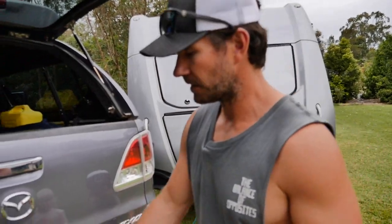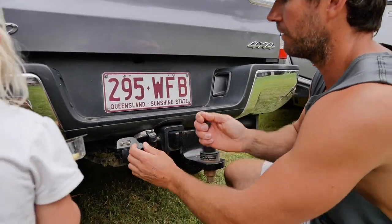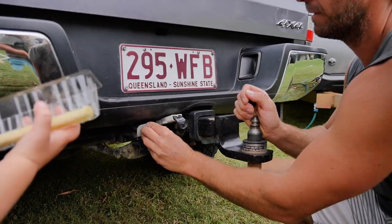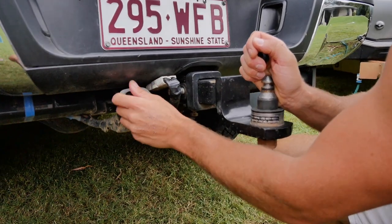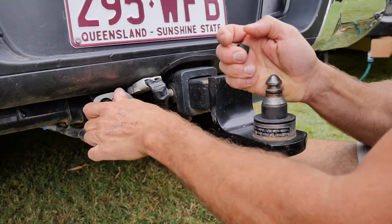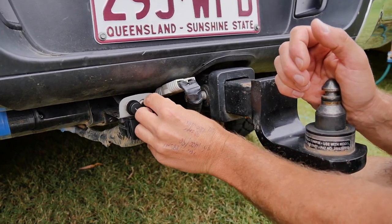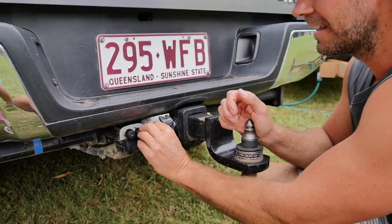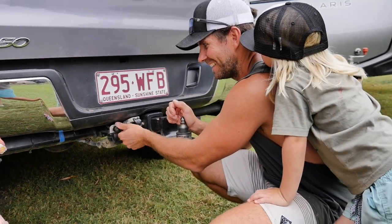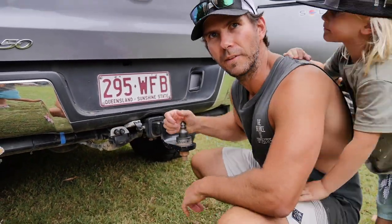So left and right — here's my inflation valves down here, little Schrader valves on the back. We'll screw the left one on first; the instructions say to do the left one first. Spin it on — there's a little rubber seal in there, so just nip it up to prevent any leaks. Something to think about: make sure you space your inflation valves far enough apart. Mine only just make it. Then the right one goes on, and we're going to have a look at the gauge.